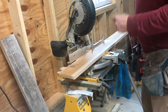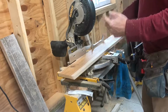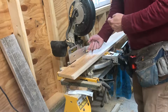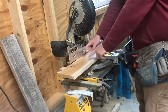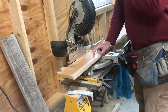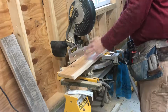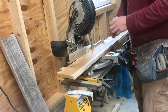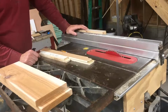Next pieces that we'll cut are going to be 18 inches long, and those will be the sides, but they're only going to finish out at 1x2, so 1.5 inches wide. So we're going to actually get 3 per. So if you're only building one of these bat houses, you really only need to cut 1 18-inch. I'm going to need to cut 2 18-inch pieces so that I can rip them down and end up with 6 for the sides.